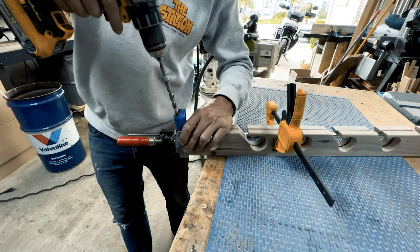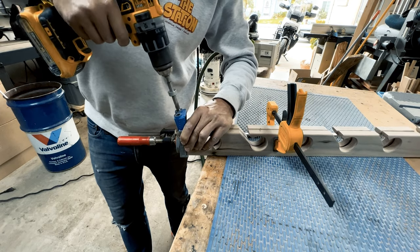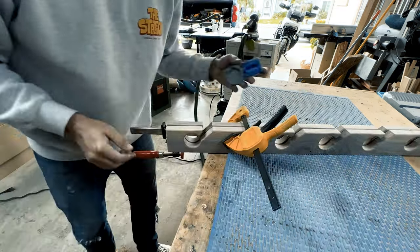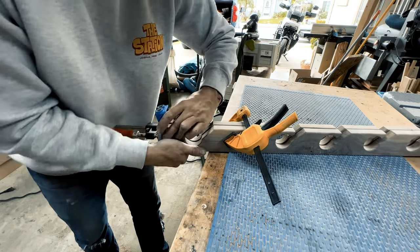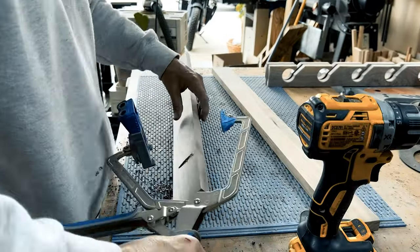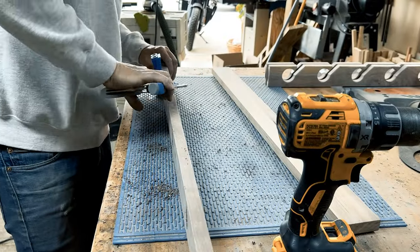You're going to need to drill some holes to mount your rack to the wall. I'm using a pocket hole kit by Kreg, which is held in place by a medium bar clamp while I'm drilling out the holes. For the bottom rack, I place the pocket holes underneath the rack to conceal the holes from the naked eye, which gives the unit more support as well.